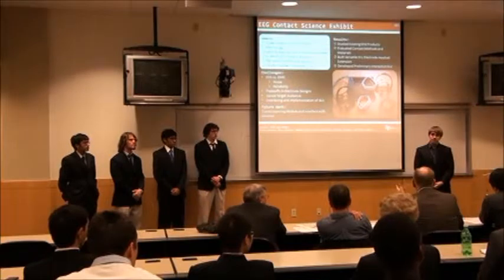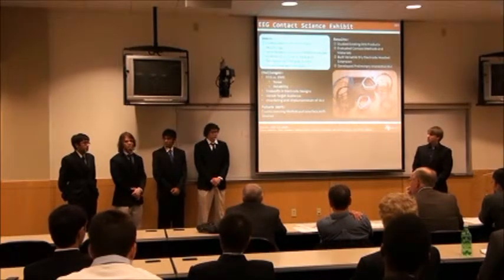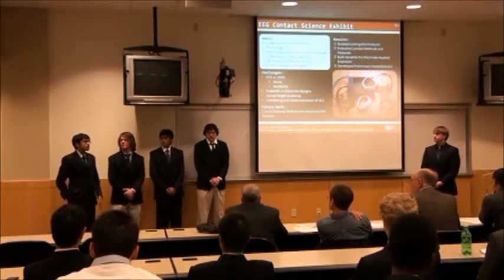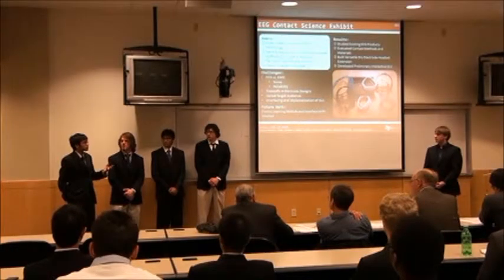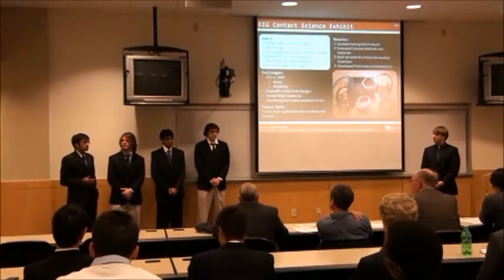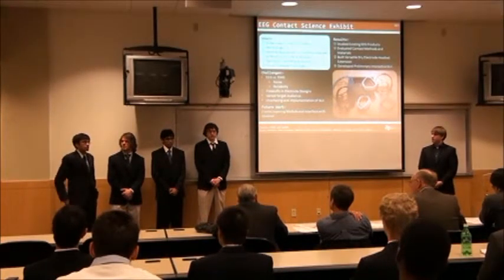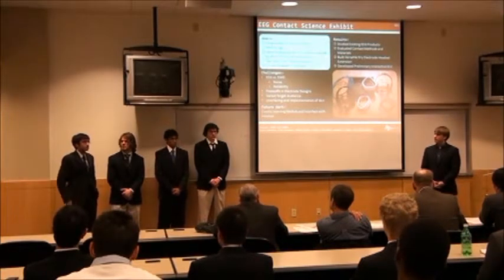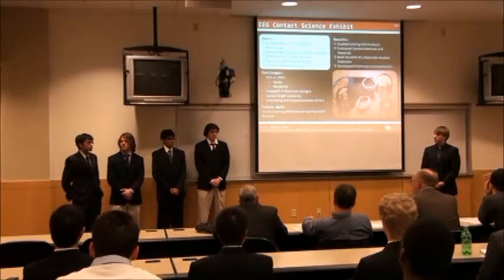Q: Have you considered the Center for Brain Health, part of the UT Dallas system, to build on what they've already done? A: Yes, to a certain degree. Dr. John Hart was one of the available resources to us, but most of the concepts were centered around electrode placement. There's an international standard called the 10-20 system that defines where to place electrodes. We targeted two along the ridge line to avoid hair and its artifacts, and also because it targets the prefrontal cortex, so we get the most useful EEG signal, which we can associate with the actuation of our learning system.